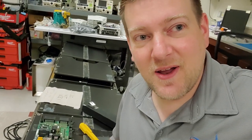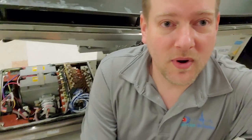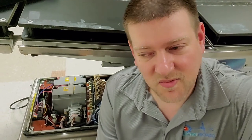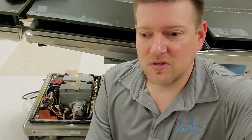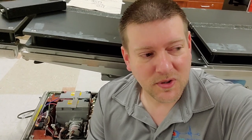The Skytron 3602 is normally a very good surgical table, and just because it has a problem doesn't make it a bad table. What it does mean is the manufacturer is taking extra precautions to make sure the table isn't used on a patient while disabled. Unfortunately users usually only figure this out when the batteries run down — sometimes mid-procedure — and everyone gets flustered because the table is dead in the water. Rule number one for all users: plug in a device and test it before you use it on a patient. Unfortunately, everybody fails at that one. Those are two problems with surgical tables I've seen in the last 24 hours — thanks for watching.